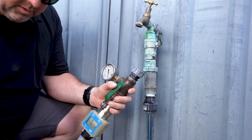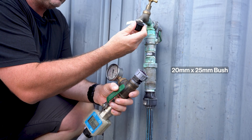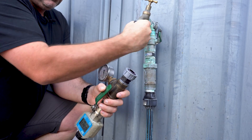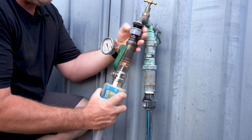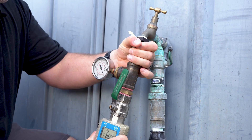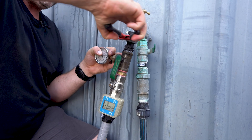The kit comes with various fittings that you can use in any situation. Today I'll be mounting a 20 by 25 mil bush to the garden tap. You'll see there's a bit of thread tape on the tap — that doesn't matter. If it leaks slightly, we're not too concerned; we're just using this for testing purposes. The test kit has a barrel union on it, which means we can fit the test kit to that thread without actually having to physically turn the whole test kit. I do have some multi grips available and you might need to use them if you find there are small leaks or you don't have the hand strength to tighten it up.